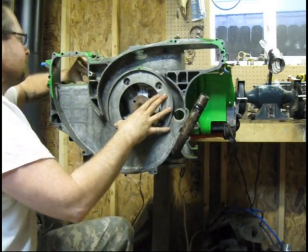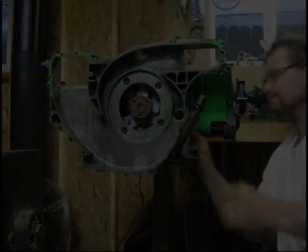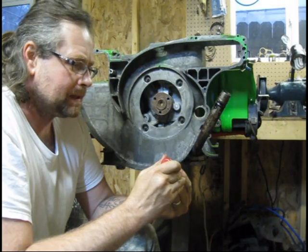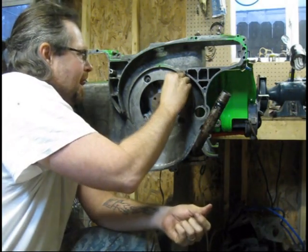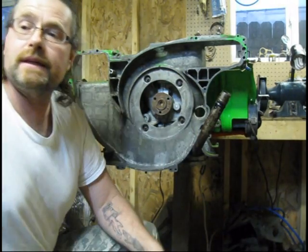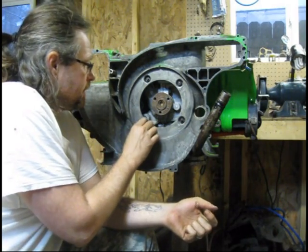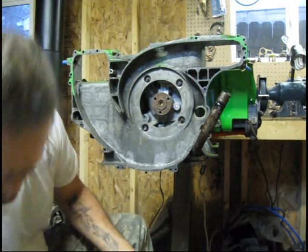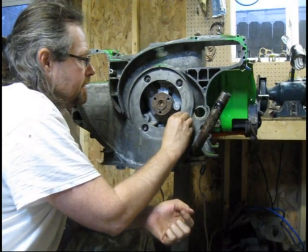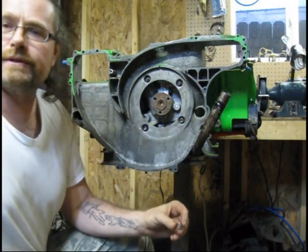It's all looking good on this side. Now all I have to do is put my washers on. I'm using a little bit of low-strength Loctite to make sure we have plenty of grip. I'm not going to be able to get to two of these nuts after I put the front part of my housing on, and I do not want this coming loose because the fan fits very closely when you mount it inside of here. You don't want this moving around and have the fan start beating things to death. You don't want to put the permanent, high-strength Loctite on here — you don't want to do that.